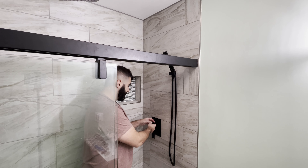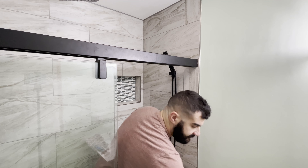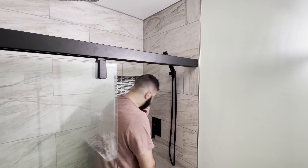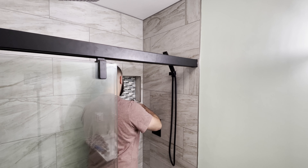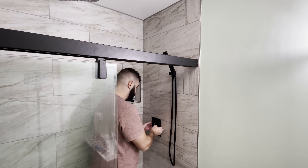There's an Allen key in each switch to actually pull the covers off. I had already done that, but it is a size two and a half millimeters for both top and bottom. So I have removed the Allen screw, so it'll just come off. We don't want to scratch the faceplate, so we'll just pull this off for good measure. It just wiggles off because it's got a rubber grommet on its backside.